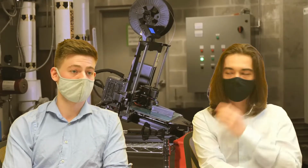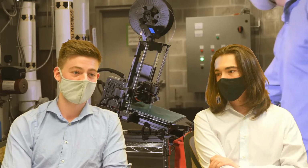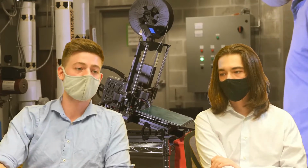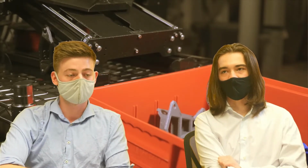Some of those being auto calibration, crash detection, filament run out. There's potential for Quinly, for example, to run an auto calibration cycle after every 100 prints or so. Ideas like that we haven't implemented, but Prusa has a lot more built in to work with. It has a lot more sensing that Quinly can work with, which is why it's a much more sophisticated kit, because it's going on a much more sophisticated printer.